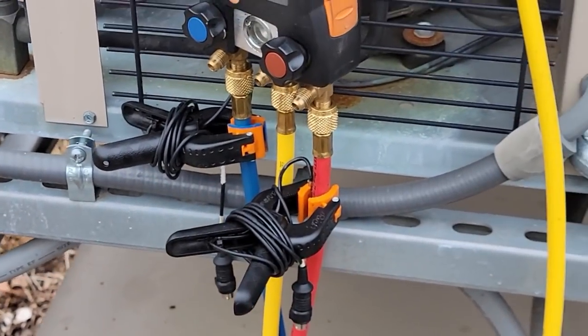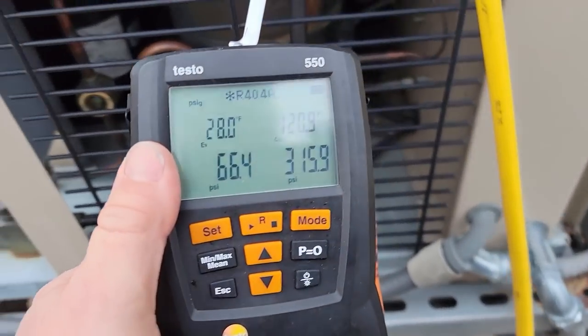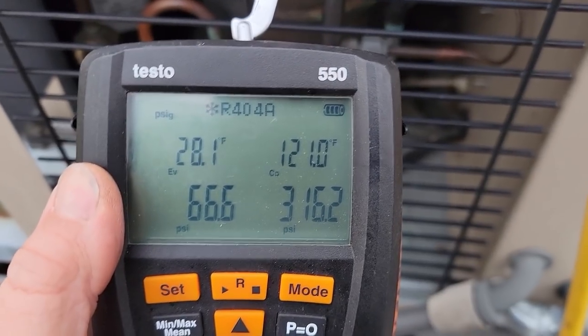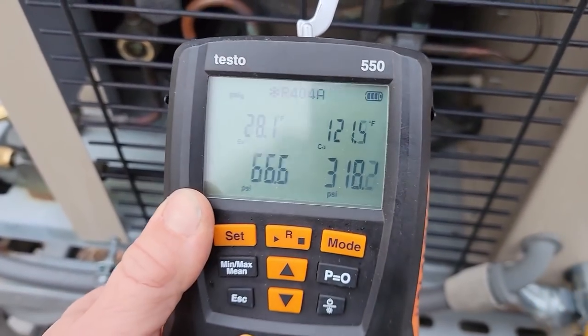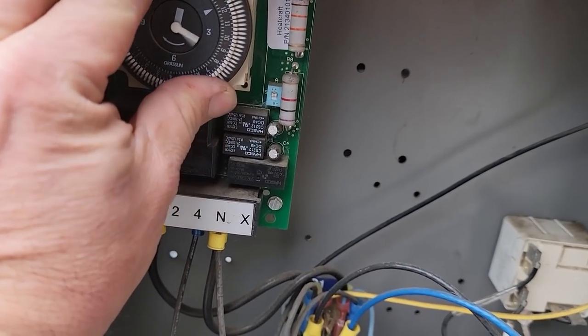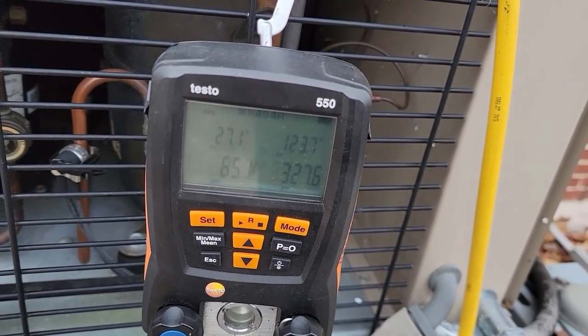We went a few more ounces up. I was going to take it up to three but let's take a look at our pressures. Not that I like to focus on pressures, but it's pretty cold out here. We're running 120 degrees on this charge, which for as cold as it is seems a little on the high side. Suction's looking a little high too, which is kind of scary. I hope we don't have something else going on here besides just low charge. Let's do a pump down — it's looking like I may have charged in a little too quickly. Let's see if it'll pump down and find out where our level is.